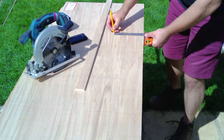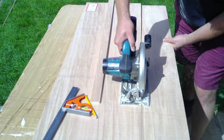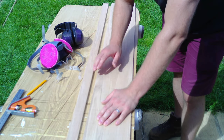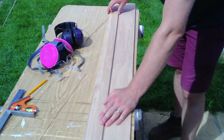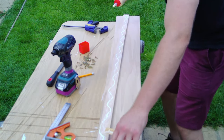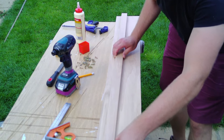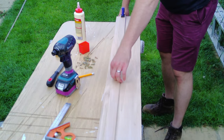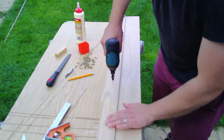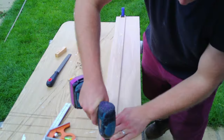The second line I drew is going to be the total width of my sled. It's good to cut along this line as straight as possible, but don't worry too much. We now have the basis of our jig cut — the bottom of our jig and the rail that will sit on top. I then applied wood glue along the fence, making sure it's evenly spread, and stuck it to the base along the line I had already marked out, making sure the true straight edge was facing the correct direction. I then used a countersink to make holes for the screws to hold the fence in place while the glue dried.